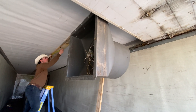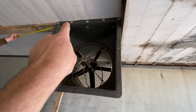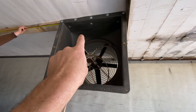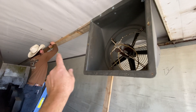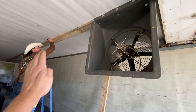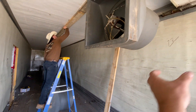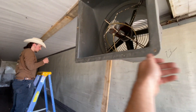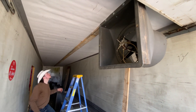Success! The first fan is mounted — worked like a charm. We got it screwed onto the front face with washers and larger screws, and on the bottom flange as well, so it's pretty sturdy. In between the fans we're going to have sheets of plywood, because you want the air to be blowing through the pack of wood and back up — not just blowing between the fans. You want all the airflow through the lumber, so we do our best to ensure that.